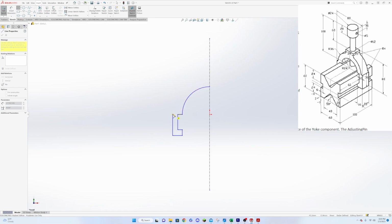We're going to come away, come back to it. We want to come back to it that way. So we have a little bit of an arc here. You can see on the drawing it's calling for a radius above 4 on that arc. We'll come back to this point. We'll draw up to somewhere roughly here. Stop that arc. Come back to it. Draw another small radius arc. We're going to go up vertical. And then we're going to come across horizontal, and click on that line. And then we can push escape. So that's roughly the start of our drawing.